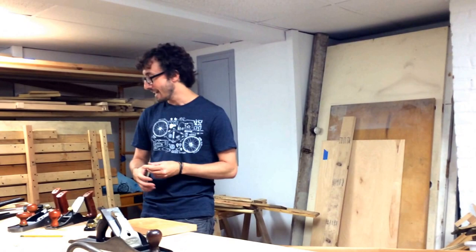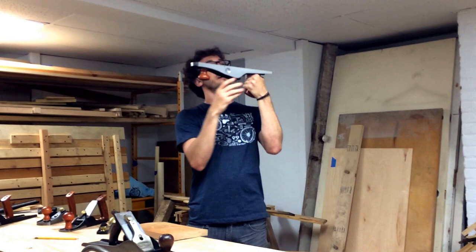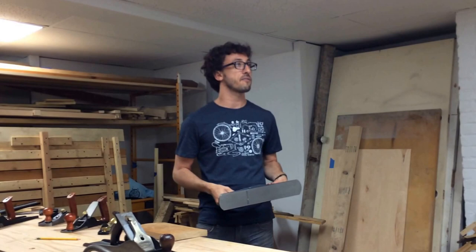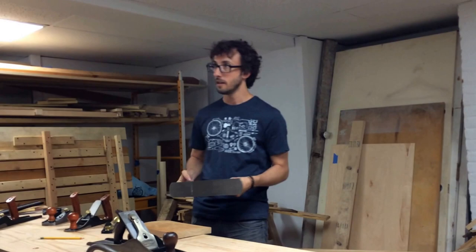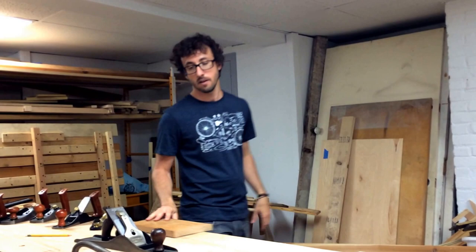It's difficult because technically with a hand plane, because of how they work, it's theoretically impossible to get a board flat because the blade always sticks out from the bottom of the plane. If you keep using the plane on the board, no matter what, it's always going to take the high spots off. So it's possible to go from flat to less flat and make a cavity in the board, for example. Most of what using hand planes is about is knowing how close to flat you are, and tuning the depth of your cut and how many passes you're taking across the board, and whether or not you're getting a full shaving across the board, all the way across the width. That's one of the hard things about taking a board down to flatness, and we'll see why that comes up as you're doing things.